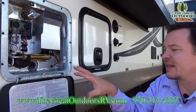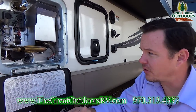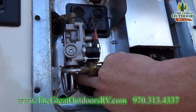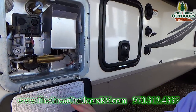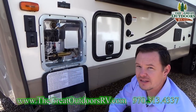If you have a gas-electric water heater, you'll want to turn off the electric side in case you plug in your camper throughout the winter. The way you can tell is if you have an on-off switch right over here — go ahead and turn this off. That way if you keep it plugged in to maintain your battery, you're not going to keep that element heating up during the wintertime without any water in the system.